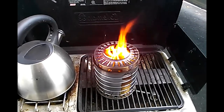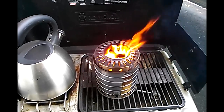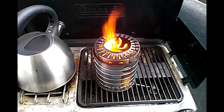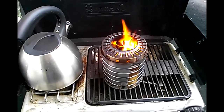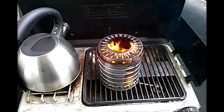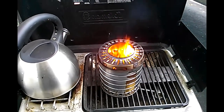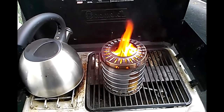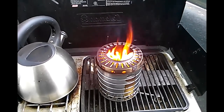The reason I decided to make this one with so few and very small primary air holes is because if you look up on YouTube the 'magic peanut stove' or 'blue flame burner', you'll find a couple of designs based on the concept of a lot less wood gas to air. They do seem to have a very gentle burn like this one is exhibiting, and they produce a very clean blue flame. I don't see a blue flame here, but it is the middle of the day.